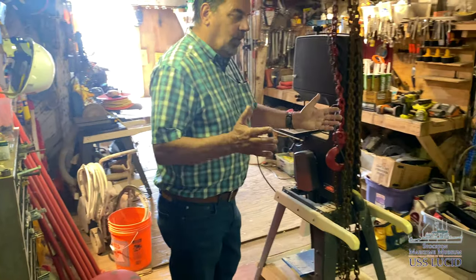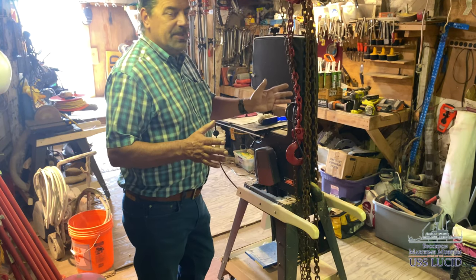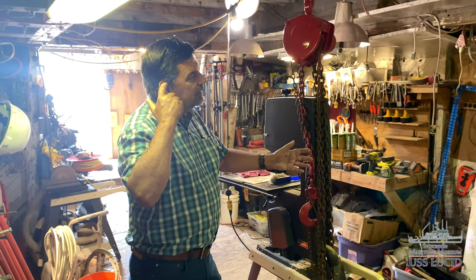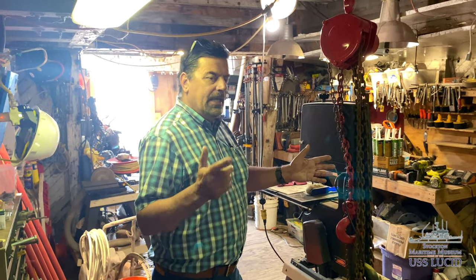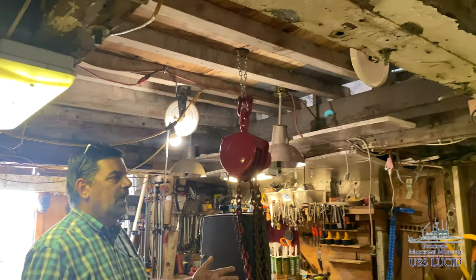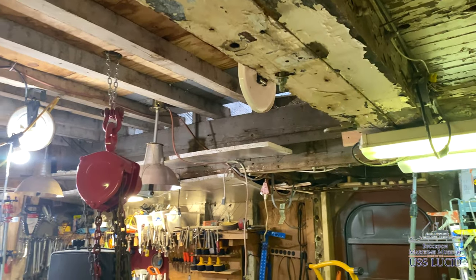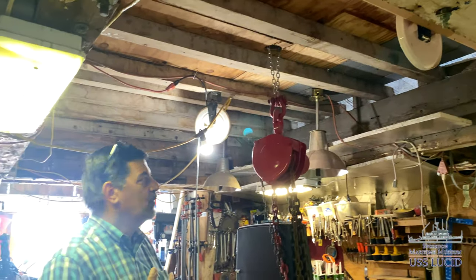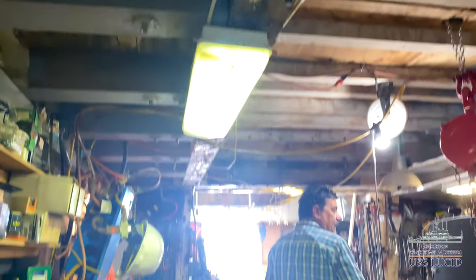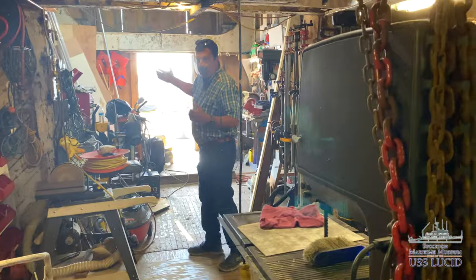Originally, this was what was referred to here as boiler flats. There was a diesel-driven boiler in here that generated heat for the heat exchangers throughout the ship, heat for the steam table, for the galley, for the steam kettles, and a distilling plant called a badger, which was used to take seawater, boil it, take the condensation, and make fresh water out of it. So this was boiler flats, and it has been opened up through a watertight compartment here when the civilians had it.